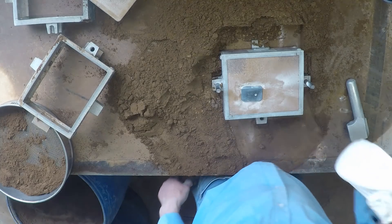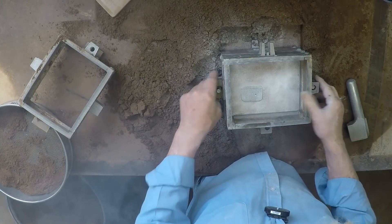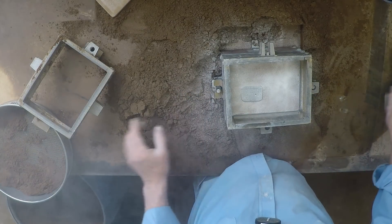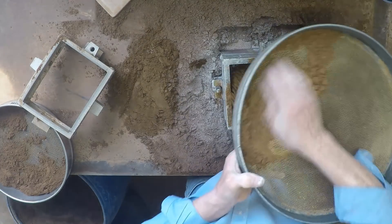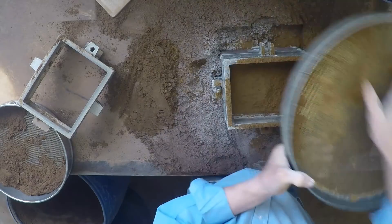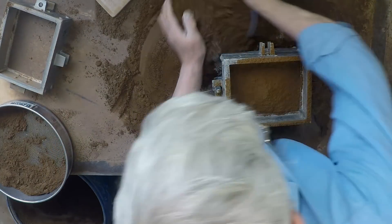So now we'll make the odd side that we'll use each time. I will actually use some fine sand in this — not that I need the finish of course on an odd side, but the fine sand is stronger. The facing sand is stronger than the backing sand because the backing sand has been used more and it's had the bond burned out of it, whereas the facing sand is actually half new sand, so it's a lot stronger.